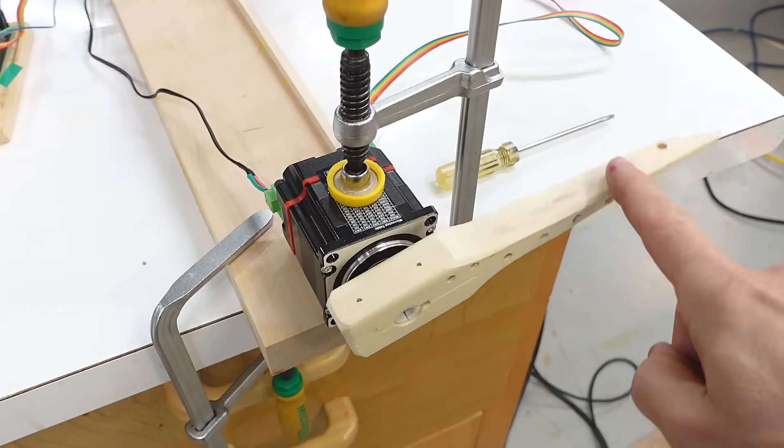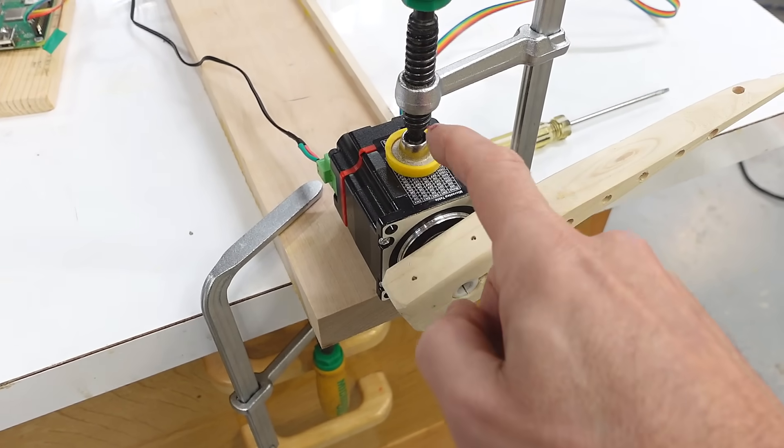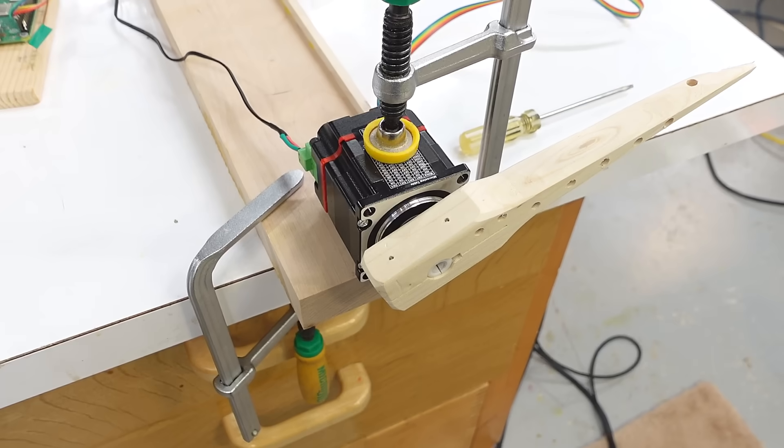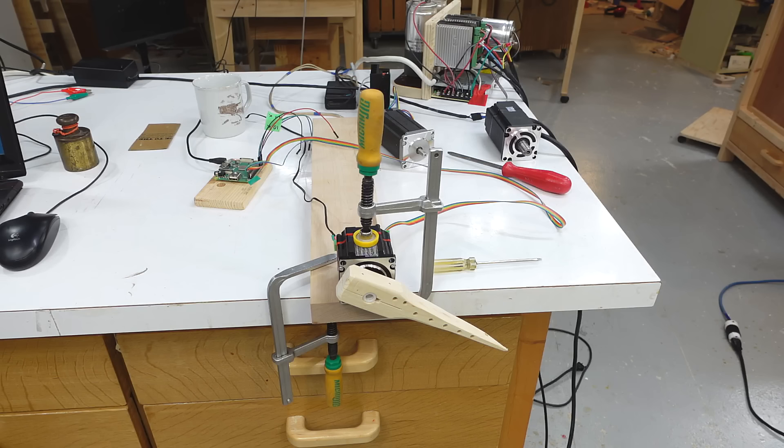The problem is this long arm has got way more rotational inertia than the feedback loop inside this motor is designed for, and I just can't tweak it. Giving the steps a little bit of time plus a bit of ramp up and ramp down makes it a little less jumpy. That motion takes 160 milliseconds, although the last 60 of it is just for settling, so with the right curves it might get down to 100 milliseconds.